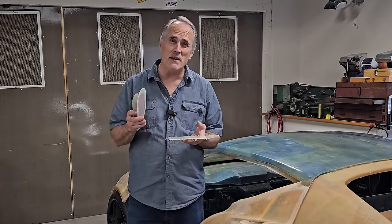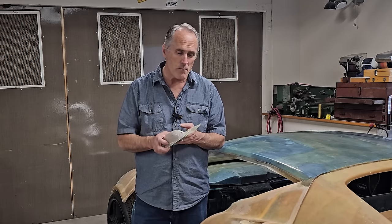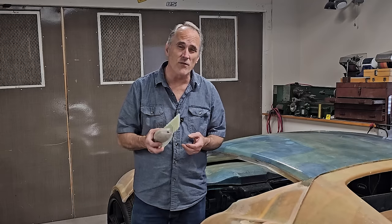Now we've taken a look at how just a little change in shape - some geometrics - can improve the structure. We went from a nine-layer unidirectional fiber sample down to three thin layers with a foam core in the middle, both of these holding over 400 pounds on our test jig. I think we could have pushed a couple hundred more pounds with more weight available. We've seen how structural performance changes come about just by changes in fiber count, cores, and geometry.